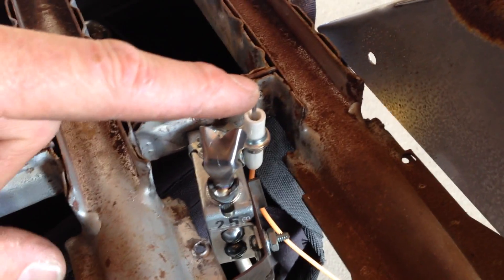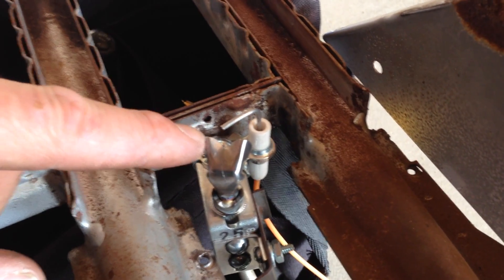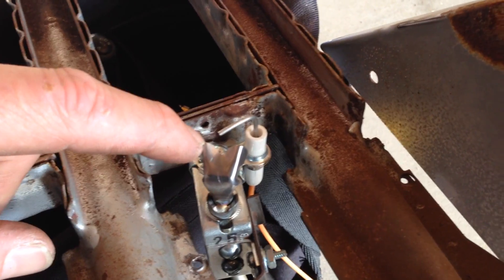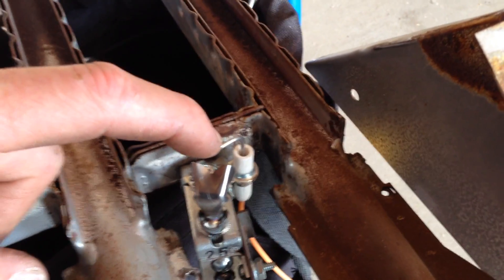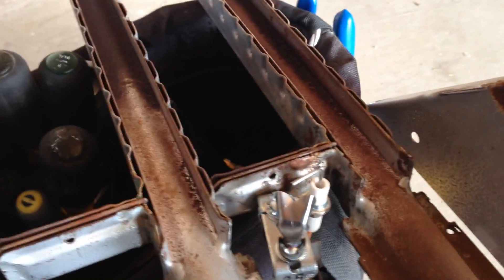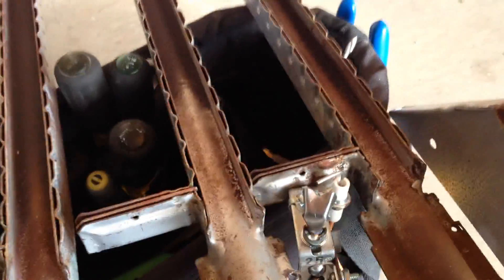You like to run it on a horizontal plane even with the top of your pilot hood. And you want about an eighth of an inch gap from the end of your tip to your pilot hood — that's where your spark is going to take place in your pilot ignition.